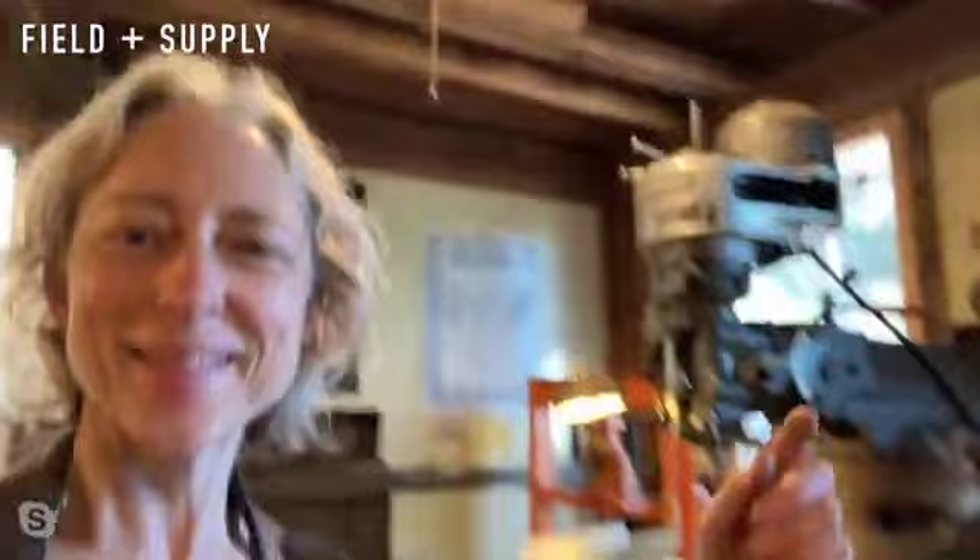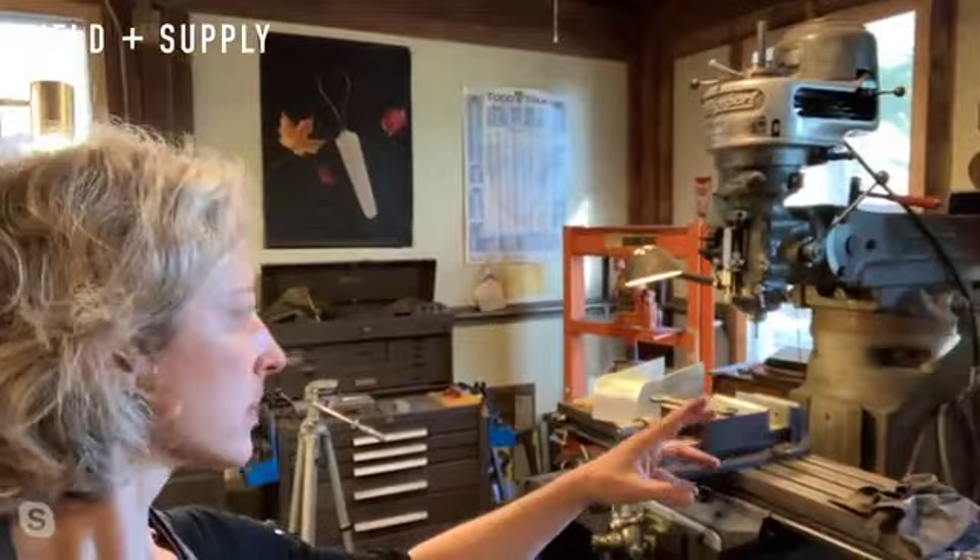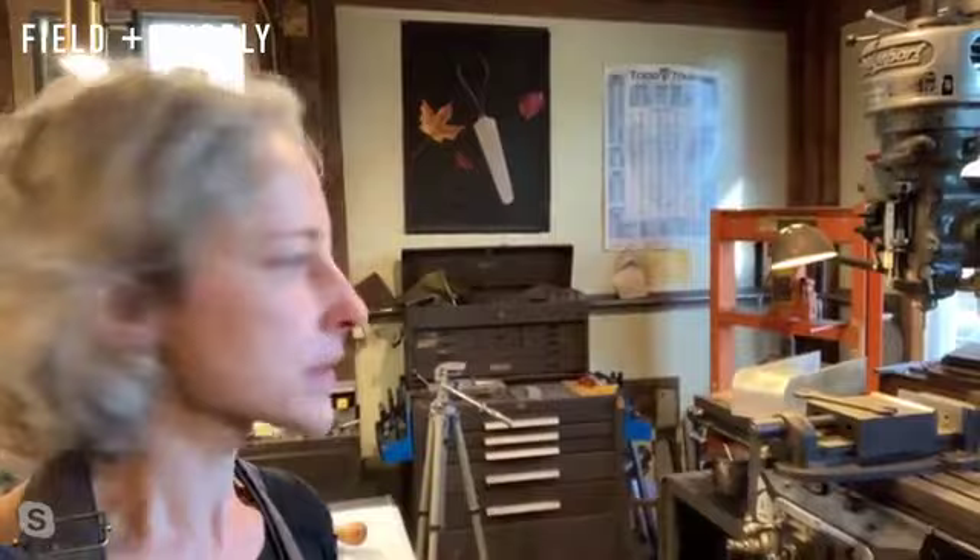This is a Bridgeport, which is a fancy drill press. You can slot and change the angle of the head in different ways. This is how the chopstick joints that have an angled joint on them get machined in a milling machine, so you have a nice, precise joint with a really tight and secure fit-up.